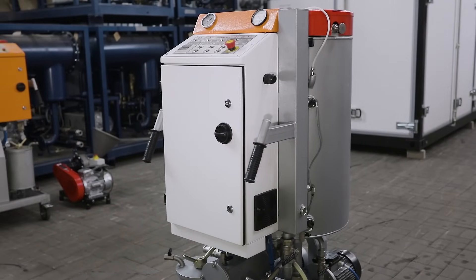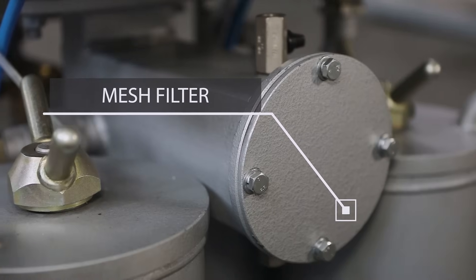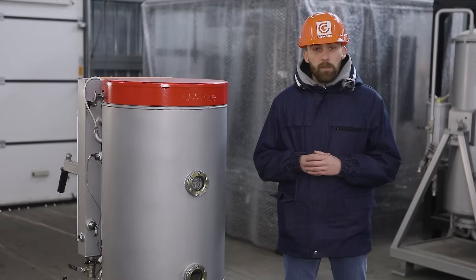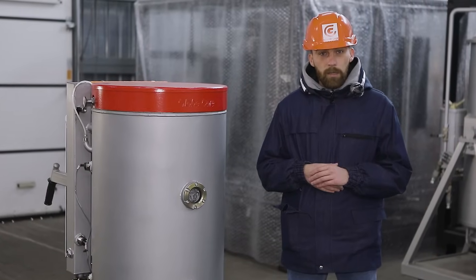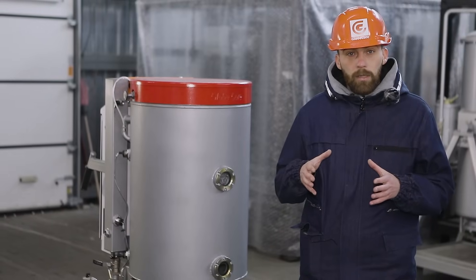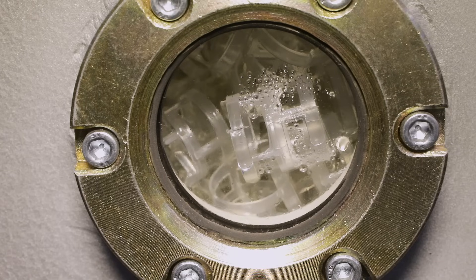The principle of CMM-1LT unit operation is simple. The oil, driven by vacuum, passes through a coarse filter with a filtration fineness of 200 microns, after which it gets inside the vacuum tank where the heater is located. Rising from bottom to top, the oil heats up and gets into the other part of the column through a special channel lid, coming directly to special fillers.